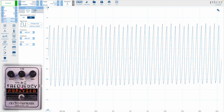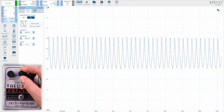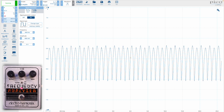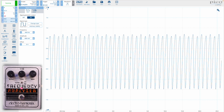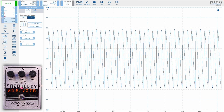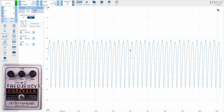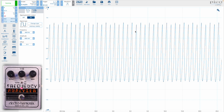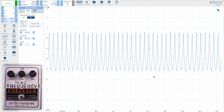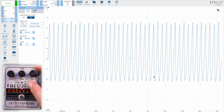So what we've got right now — we can see it's still not exactly locked on. Because the two sidebands are the sum and the difference, we have a high-pitched signal between these peaks. And then this slow oscillation we're seeing is because the two frequencies are almost matched — the low sideband has a frequency of nearly zero. That's why it's going so slowly. That's what we're hearing there.